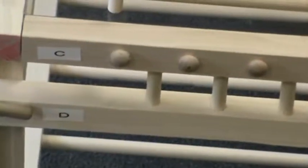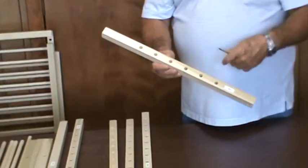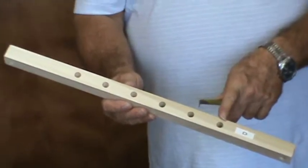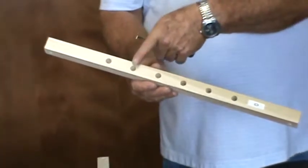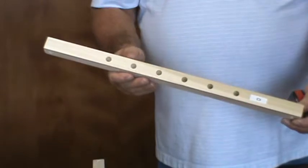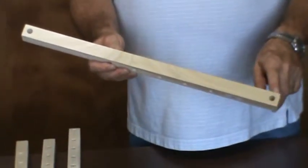Take that same piece and center a 7/16ths inch hole 1 and 1/8 inches deep on each end. To cut and drill the two top shelf lower cross pieces, parts D. Take a 1-inch by 36-inch square and cut to 20 inches. From each end mark and drill a 7/16ths inch hole 5/8ths inches deep, 5 inches on center. From the center of one of these holes, drill 4 identical holes 2 inches on center. There are 6 7/16ths inch holes on this side. Take the same piece, turn over, and from each end mark and drill a 7/16ths inch hole all the way through, half inch on center.